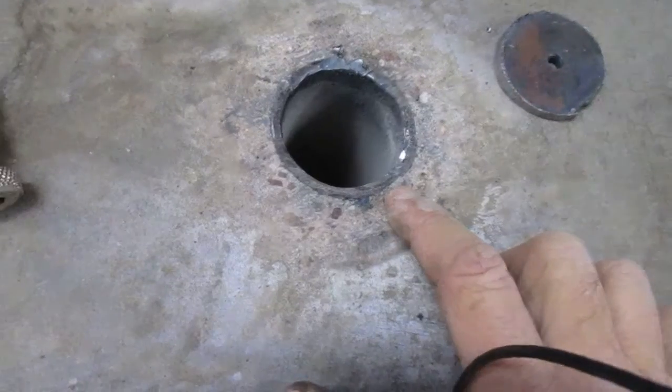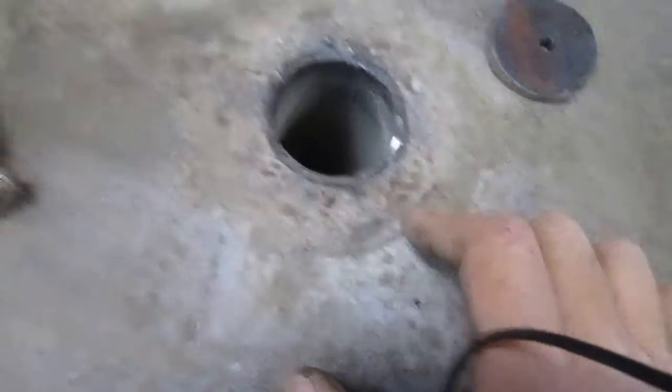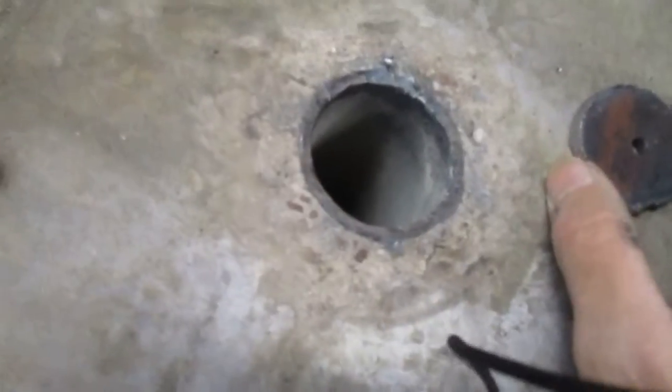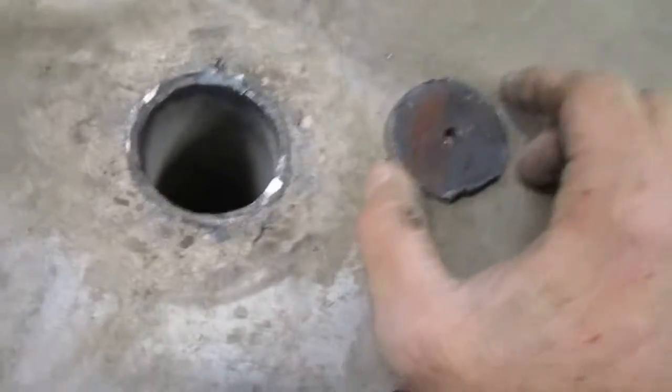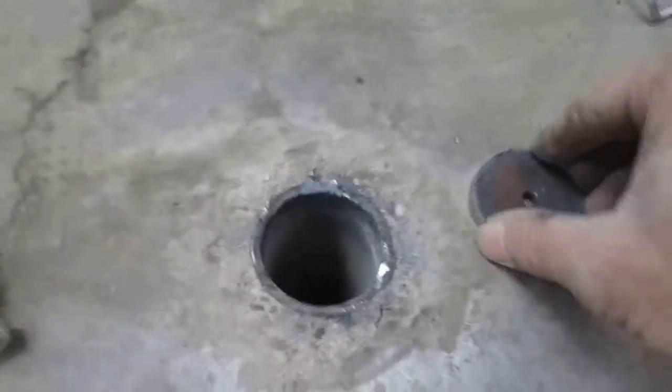Getting that concrete in that hole, I don't want to waste that much time. I got this plate steel down there — there's a piece right here — and I got a hole saw kit. So cutting a score with the hole saw gives me a point of reference to cut with the cutting torch pretty quick.